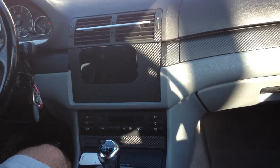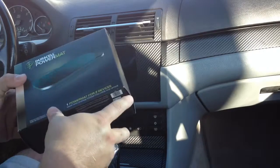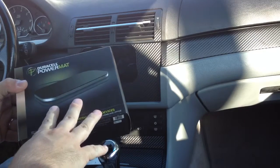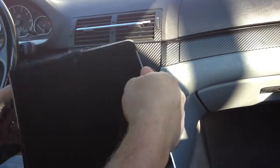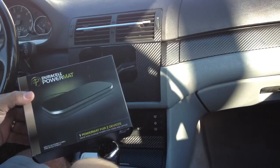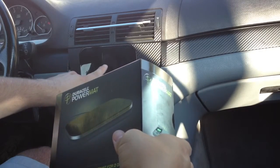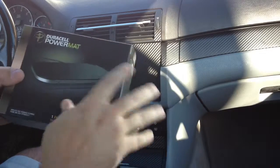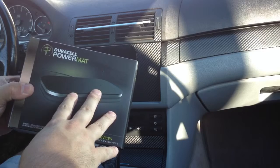Here I wanted to demonstrate the wireless induction charging system that you can't really buy for the iPad. I've retrofitted it to work inside of this case here. I've also purchased a DC to DC power supply that will power it from 12 volt to 19 volt, which is what the PowerMat inductive charging mat requires.